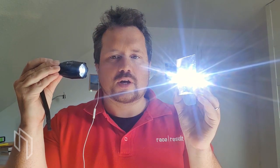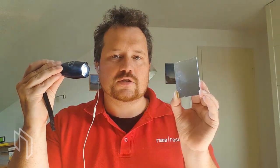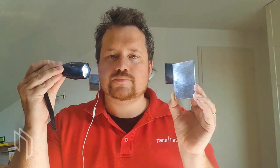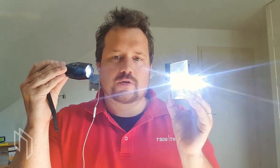Now imagine the mirror being the chip, or the antenna of the chip. The way the chip communicates back to the reader is by changing the reflection parameter of its antenna — basically by short-circuiting or not short-circuiting its antenna. You could imagine this the same way as flipping the mirror: if you were the receiving antenna, you see the light from the sending antenna, and if I flip this mirror, you see a change of reflection. That flipping is the same thing the chip is doing — changing the reflection of the signal coming from the reader, and therefore transmitting data.